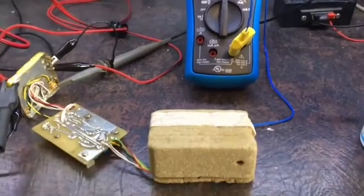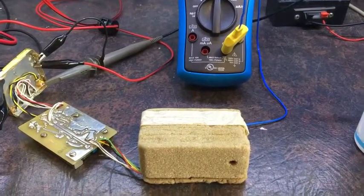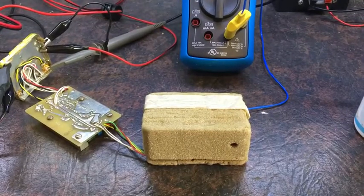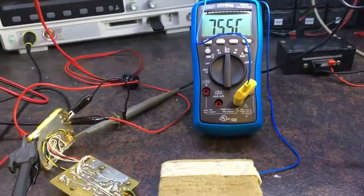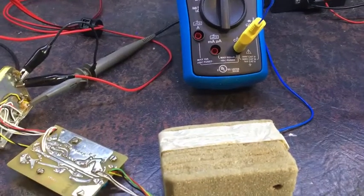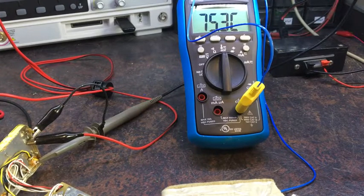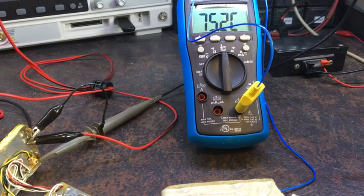Apparently, each OCXO is usually individually set, which is why it's got the trimmer there, because each crystal is slightly different, so it may not perform the same way, and so each one's tuned for the optimal temperature for that crystal. So that's what I need to be careful of, because before I was going to go middle of the range of the tuning.